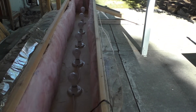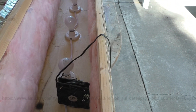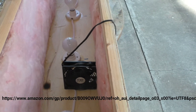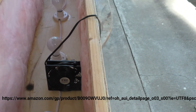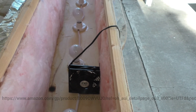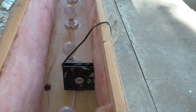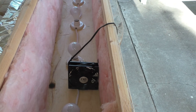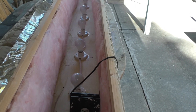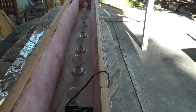Obviously LEDs aren't going to do us much good — they run very cool. Here's a little muffin fan — it was warm in there! This fan helps push air around inside the box and helps ensure even heating along the component you're curing. The fan was about $20 off Amazon, 110 volt, just plug it right in. When the light bulbs turn off I have the fan turn off as well, so we don't cool the oven excessively. The whole cycle time between light on and light off is about two to two-and-a-half minutes.